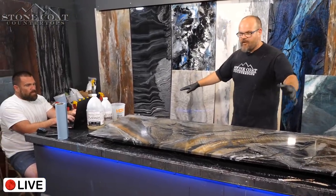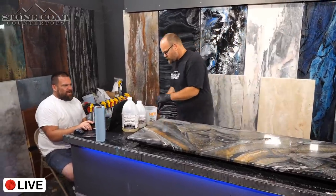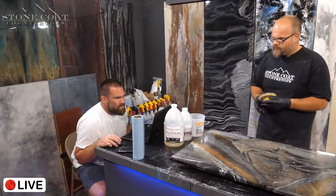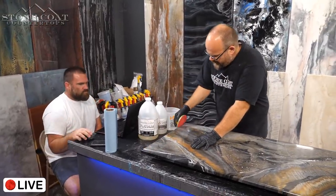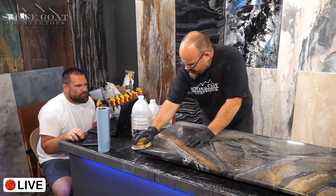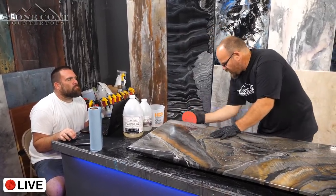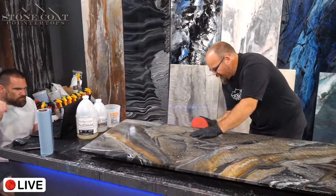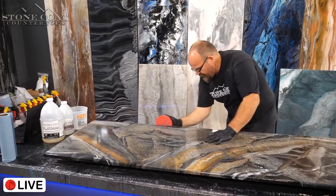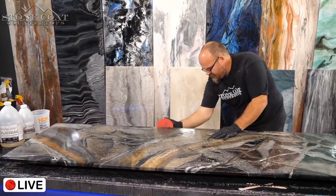Any questions from the audience that I can answer? I've been answering them here by typing, but let the other viewers know, what grit sandpaper did you just sand with? 220 grit. Sweet. 220 grit. So why did I not sand with my random orbital on the edges? Well, all I need in this coat is a mechanical bond, okay? I'm scratching the surface to create and promote adhesion.